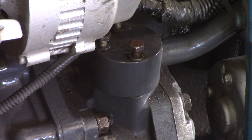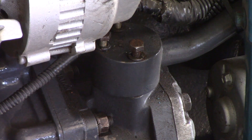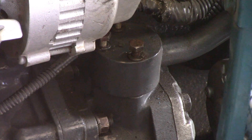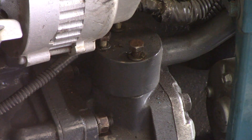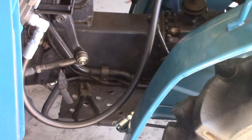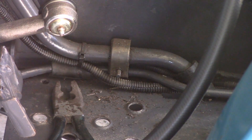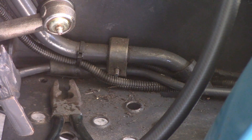In order to do that, I'm going to have to take the whole pipe off, because there's no way I can get in there to TIG that while it's sitting in place. So I mark where I want to put it — it's going to go up underneath the battery, somewhere close underneath the battery. I think that'll be the best spot. But I've got to take the whole pipe off to do that. I'll need to drain all the oil out first because as soon as I take that return pipe off, I think the oil's going to pour out everywhere. I'm going to take the drain plug out and get the oil out of the tractor first.